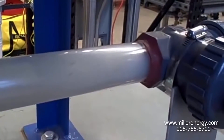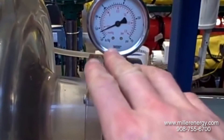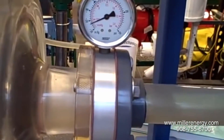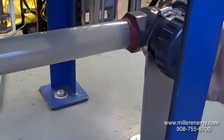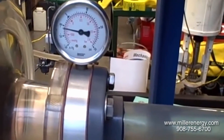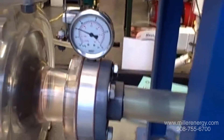It sounds like rocks — literally like rocks going through the pipe. We cause it by dropping to too low a pressure, causing flashing to occur. When the pressure rises again, the bubbles collapse, and that's when the cavitation occurs. I'll open the valve back up now — that increases the pressure on the suction side of the pump, less and less vacuum, until we no longer flash and we no longer cavitate. And that's a happy pump.